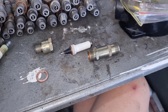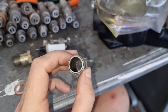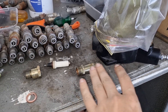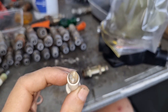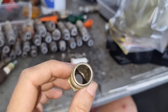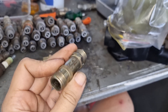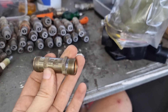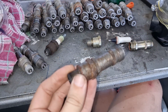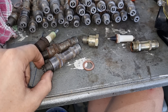It does the job, but not a full 100% job. You should also shove down some dielectric grease, which is a special type of grease that is non-conductive and quite resistant to heat. So you pack that full of it, but you make sure that you keep your electrode nice and clean - this needs to be clean. The rest of this can be basically whatever, as long as it is not conductive on the inside. The outside is not important; as long as the threads are good, the case can look like anything. You'll see most of the cases on these have got a fair bit of surface rust on them - we will clean them up and paint them and they will look exactly like that. These came from the exact same batch - here's a clean one, and this is before.